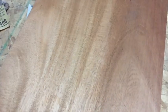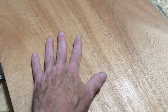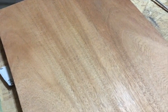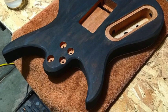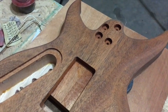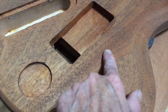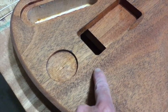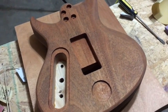The other advantage of using a grain filler — look at that surface closely and remember what it looks like. I'm going to show you a guitar body that was made from the same mahogany that these boards were cut from. This guitar has had grain filler applied — it was black, applied fairly heavy and then sanded off. Afterwards I put a thinned polyurethane sealer over the surface. As you can see, that grain is now very dark. There's a big contrast between the pores and the surrounding wood, and that's what gives the guitar a more appealing look.